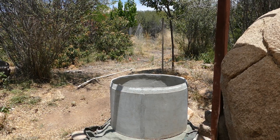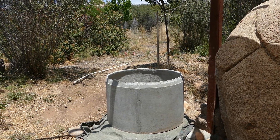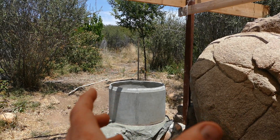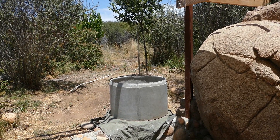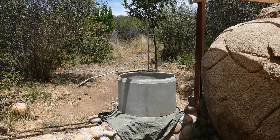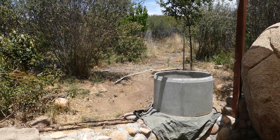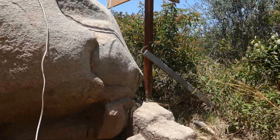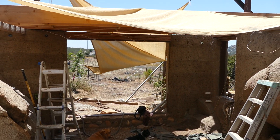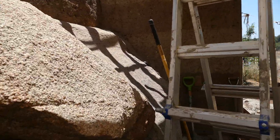You can see we started the water tank — there's going to be a 300-gallon ferro cement water tank, just like the ones I make for rainwater harvesting. We're going to incorporate one right into the wall, so all the water from this roof will go directly into this tank. The overflow from the house will go back to the food forest to water our plants and build healthy soil.